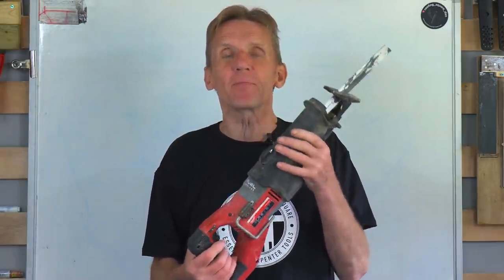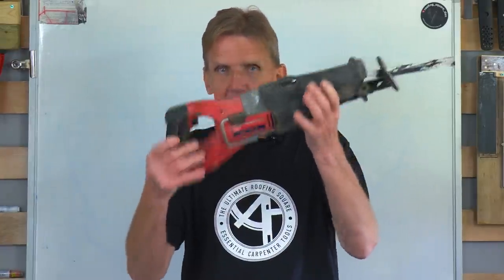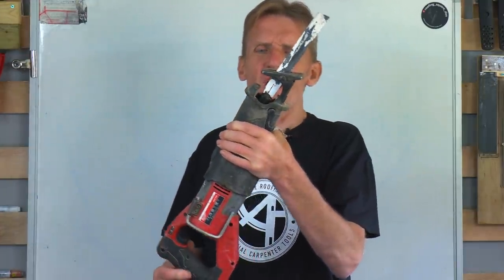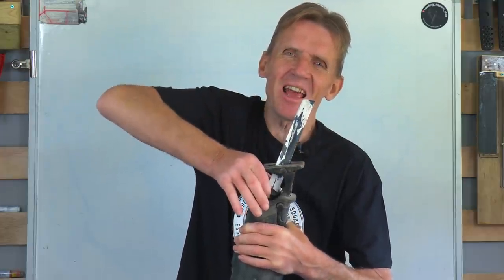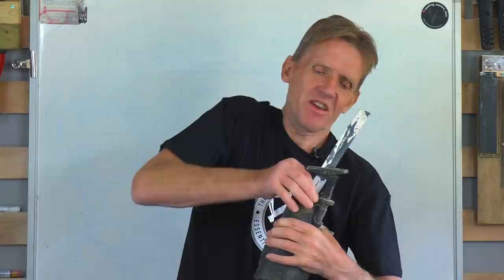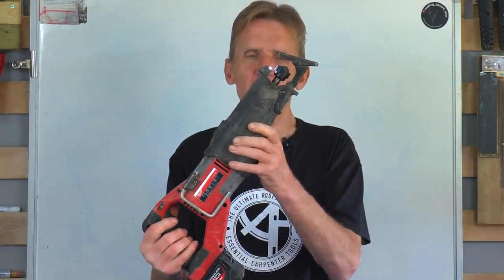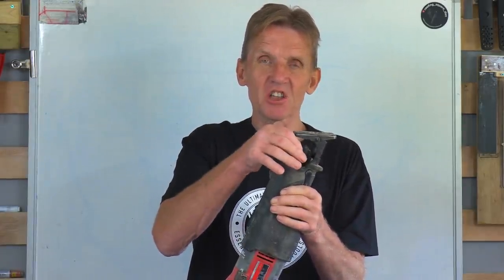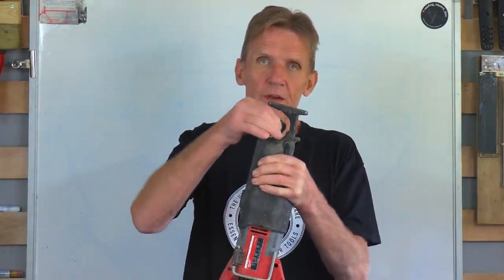So this is the reason for my update on this video, because I feel I can't just leave it there and keep fending those comments off. Battery's out at the moment. On these saws, you will find that when you look at this collet here that holds the blade in, it's kind of down there and you can get at it, but you've got to mess around with your fingers to get in there. If you've got the battery in, the collet comes out a little bit — the piston comes out and the collet is on the end there — so it's easier. Having made that come out, I should now probably take the battery out and do whatever I was going to do.